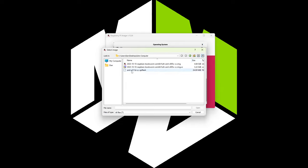Let's get this thing powered up so you can see what it goes through in the process. Jumping over to the HDMI capture — plugging the power in. There we go — it's booting up and it's currently updating the BIOS. You can see it doing it down at the bottom. It goes through the process and says 'Flash is completed,' so the BIOS has been updated. At this point you can just turn the device off, swap the SD card, and boot it up with the image.